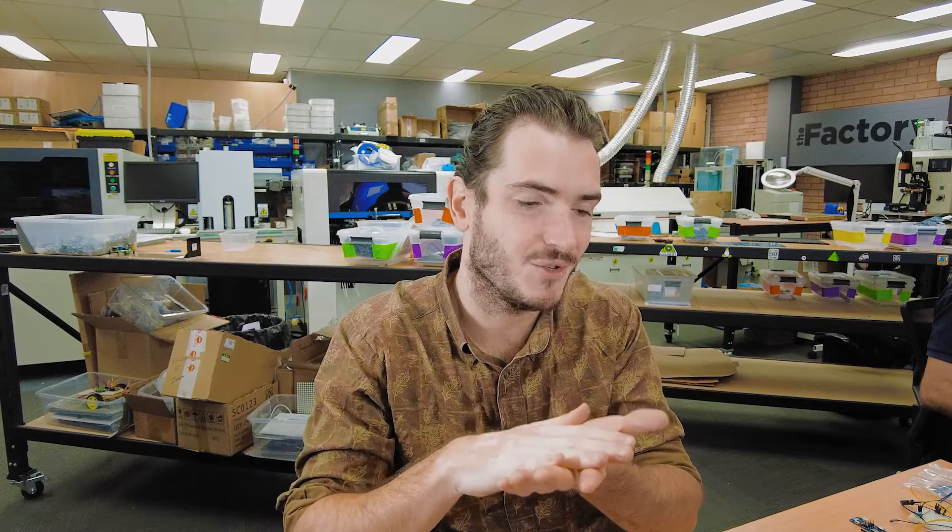With all the parts loaded, the panel set up, and the feeders set up, we're ready to do a dry placement. A dry placement is like a big confirmation - it checks the job is set up correctly and can be used to catch errors before committing to assembling a panel. Simply, this is where we place parts onto double-sided tape instead of solder paste, and you can use this to check that your fiducials are correct and that components are rotated the correct way. We don't often do this on new jobs, but when working with new exotic parts you've never worked with before, it can be a real time saver and can reveal some improvements early on.